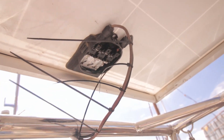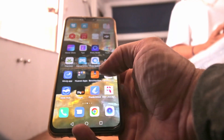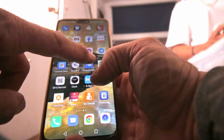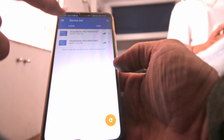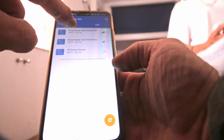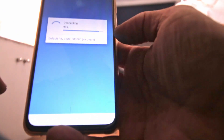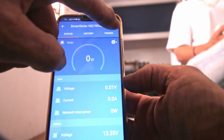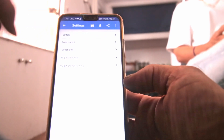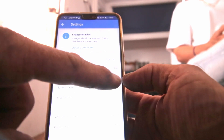The ground is hot and I put some cable ties on it so it looks good. First I'm going to open up my Victron Connect app. I see two SmartSolar regulators — this is the small one. There it is — nothing. Then go to Settings, Battery, and you see 'Charger enabled' — it's disabled.